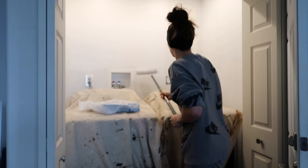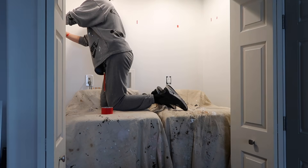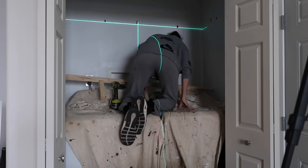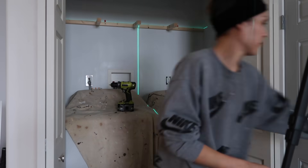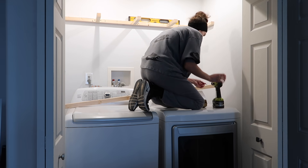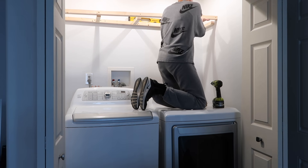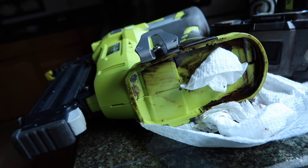This doesn't need to hold a ton of clothes or storage so I wanted to keep it simple and sweet. I'm going to start by adding the tried-and-true shelf like I have in my laundry room, doing one with a 2x2 frame. I have a tutorial on this but I'm taking some tips from Mike from Modern Builds — his latest plywood wrapped floating shelves — which I will card and link for you. You basically want to put your frame into the studs; if not, use drywall anchors. I had to leave to finish the wraparound wood and look what happened the next day — that's stain all over the battery portions of my power tools.